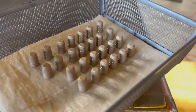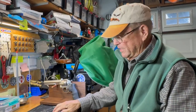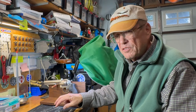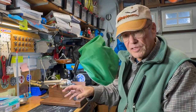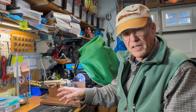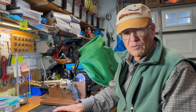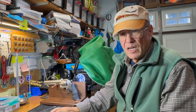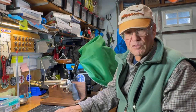Here come those few Ideal 358432, the 160 grain version, done up in Eastwood beige. We didn't make very many, but just enough to go try. Let's do a quick side-by-side comparison of the bullet that I just cast up and the zinc version that Andy sent. If you look closely, you'll see there are some minor differences between those two bullets, even though they have the same identifier and they're allegedly the same 160 grain version. There are still some slight differences between the two molds. I think the one that I have is a little older, and maybe the one Andy had is a little bit newer. But that happens, and that's something you need to be aware of. If you buy multiple copies of the same mold, maybe it's only a 2-cavity mold and you want to run 2 molds at the same time, they might be different. That's a common issue with the famous Lyman 429421 bullet for 44. There are several different versions of that one running around out there.